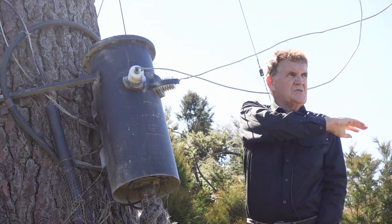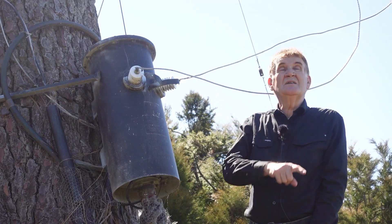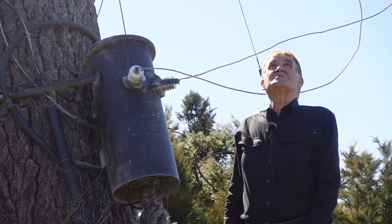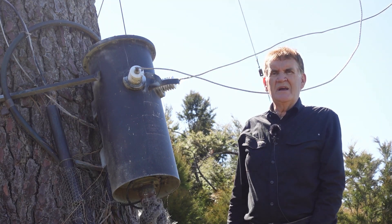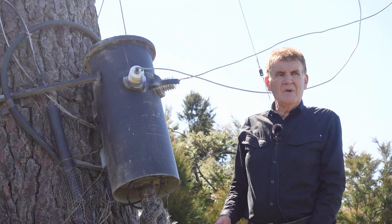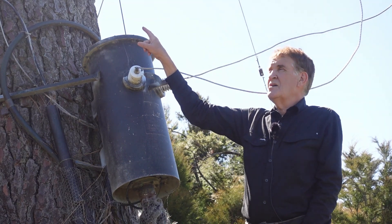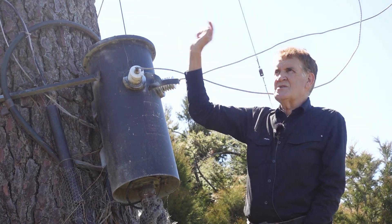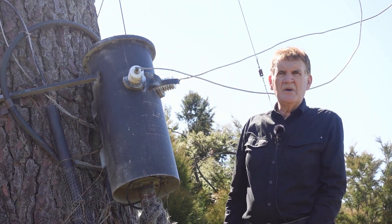As you can see around here there are just endless trees and opportunities to put up antennas. This backstay has got a 60-ton breaking strain wire rope on it, and it's also got some hose clips with aluminum wire going up, which acts as an auxiliary antenna. I sometimes use that on data with another rig running. I can also use the half-wave dipole for receiving and the big antenna for transmitting — I can receive signals within 200 kilohertz of where I'm transmitting even with the amplifier on. On the TS2000 I can receive signals even that close by, so it's pretty clean.